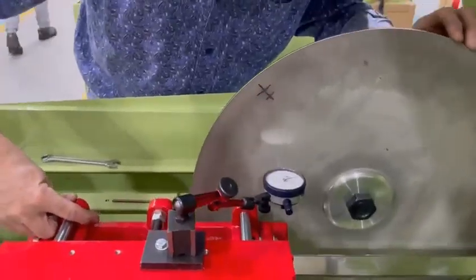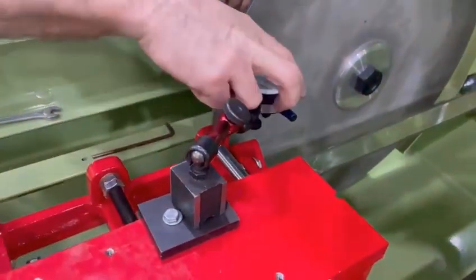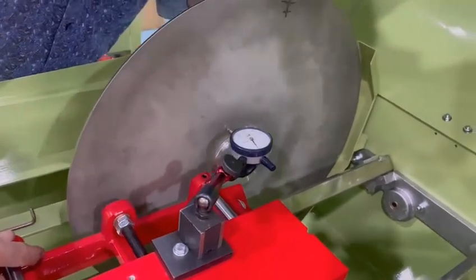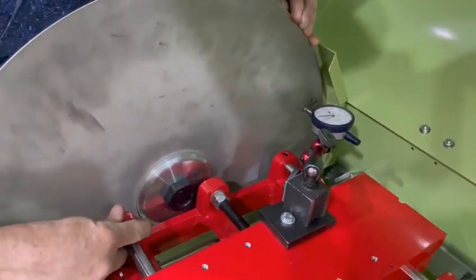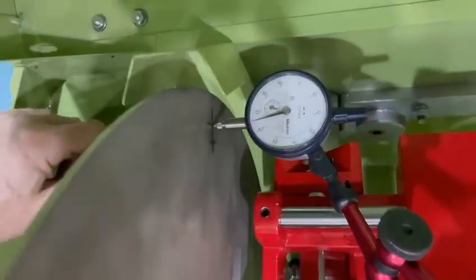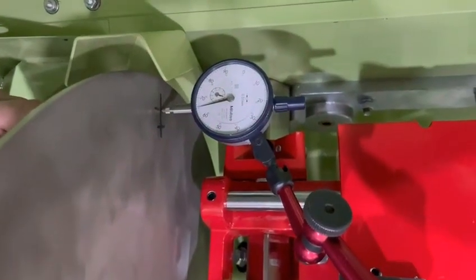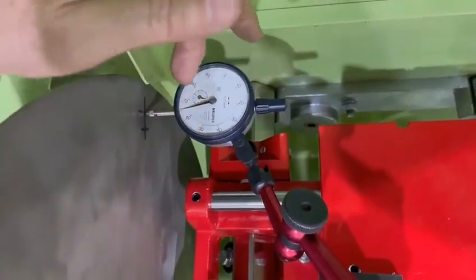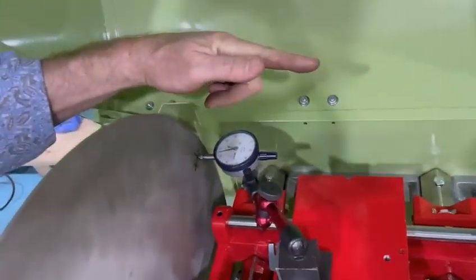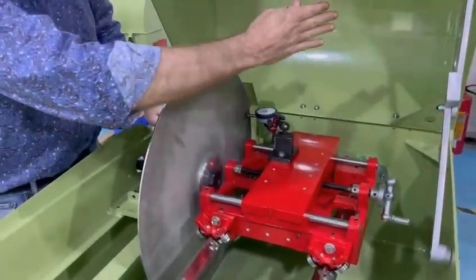I'll illustrate that now — come back in closer, I'm going to come forward. I'm almost touching my flange, so I've got to move up and reset my zero. If you bump your flange it will change your indicator setting. I come in and I'm looking for the indicator to move — it's come up one revolution. So I've come up 165. The indicator is turning to the right, which tells me this face of the blade is high. So this is low and this is high — the blade is angled like this right now.